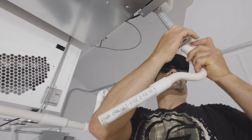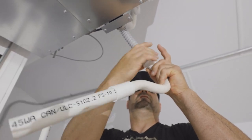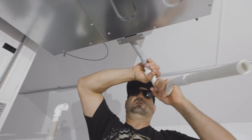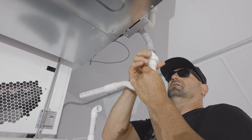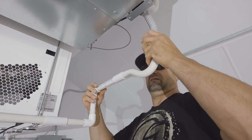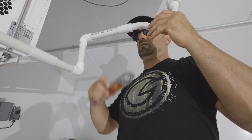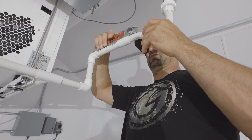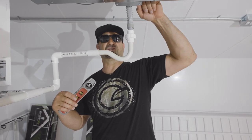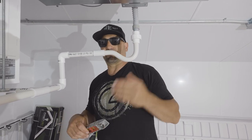I've got the union for accessibility — beautiful, nice and snug. In this case you don't necessarily always need PVC glue because the unions stick together quite well. If there's a leak, I'll glue it, but this is not under pressure and I've got lots of grade, so that's perfect. Water is going to fill up this little p-trap right here, which is going to stop any negative pressure or airflow pulling back into the unit, which drains the pan fully. That's the purpose of a p-trap — they're very important.